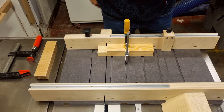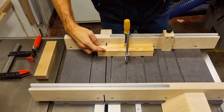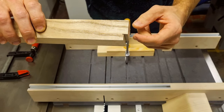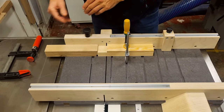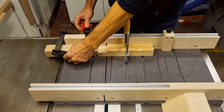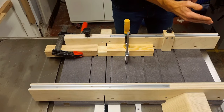There are a few occasions when you might want a stop on the other side of the blade where I have no T-track. The first I can think of is if you're cutting tenon shoulders, but for those cuts I like a stop with a small notch that gives the off-cut free space to move — so my ordinary stop wouldn't work well there anyway. In that case I just put a temporary stop with a clamp onto my main fence. But feel free to run the T-track the entire length of the fences.